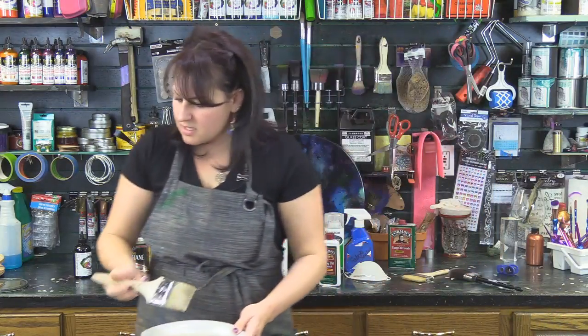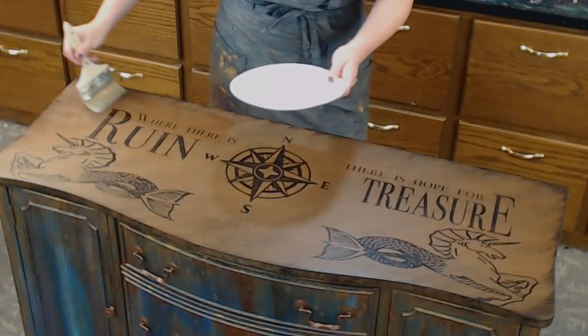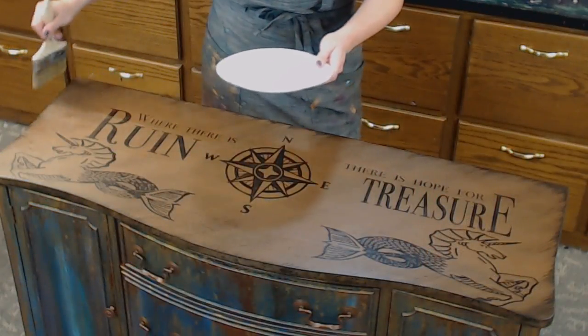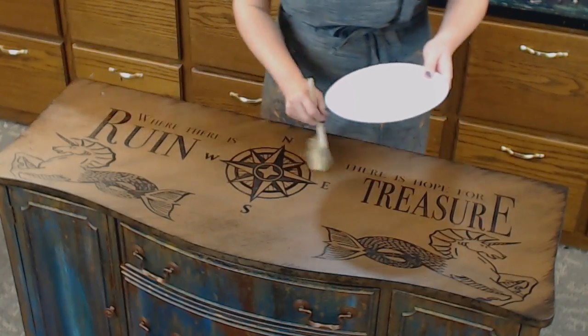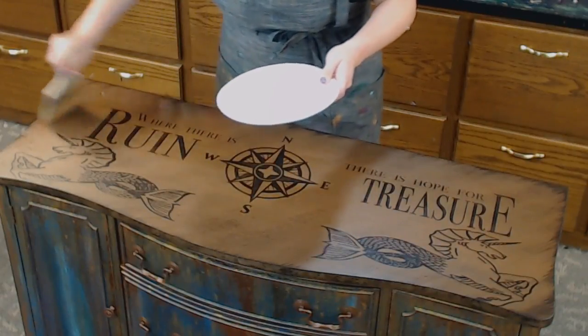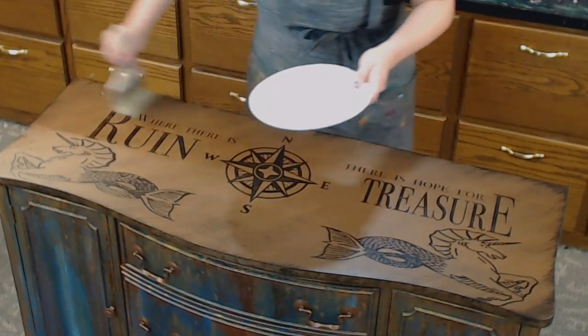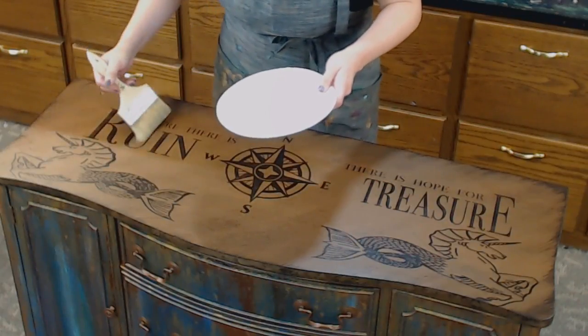While we were sitting, that wood was very dry and very old. So the older the wood, the more moisture it has lost, so the quicker it will absorb your penetrating oils, such as the tung oil finish. So keep that in mind. I'm going to give it another coat here. Again, really thin coats. And notice there's no bubbles.